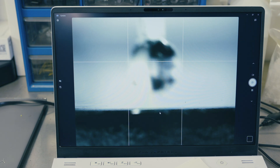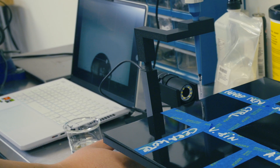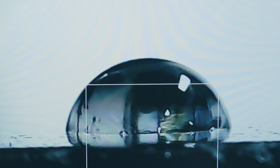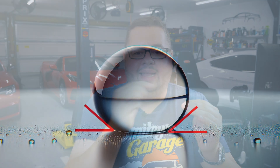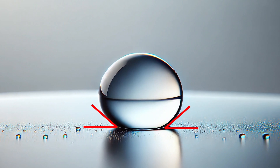We're going to dispense a precise 3 microliter drop onto the test plate and capture a snapshot quickly before evaporation. The small droplet size minimizes the influence of external forces like gravity. We're going to repeat this test four more times so we can average the results. Contact angle is the measurement we want — that is when you take a solid, place a liquid on top of it, and measure the angle at the edge of the liquid where it meets the solid.